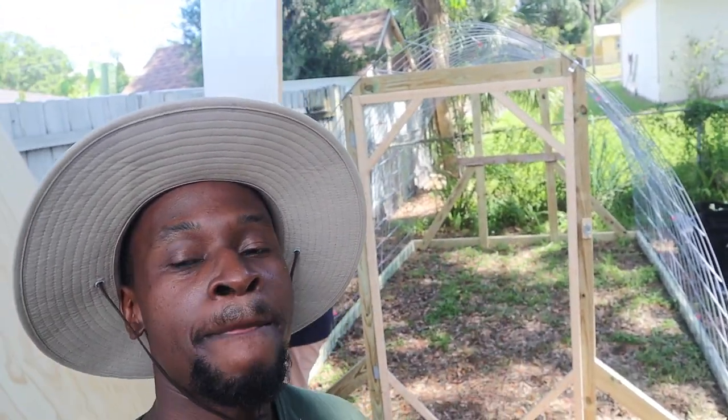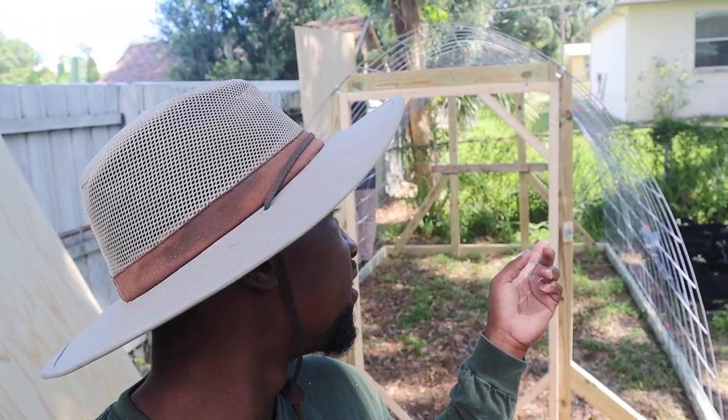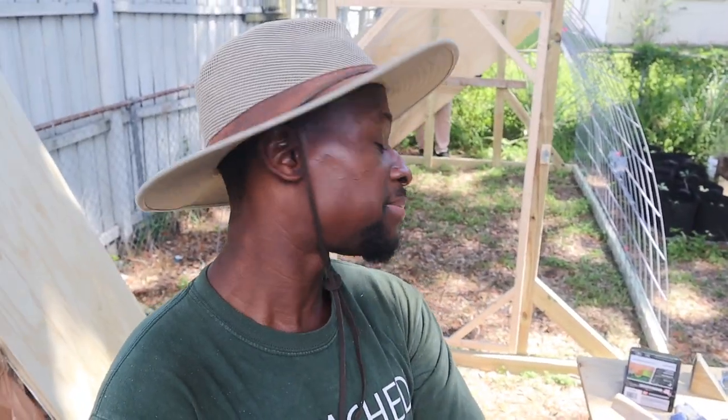First time doing doors, I will recommend you to use 1 inch by 4 inches, right, Frankie? Yes, sir. 1x4 because he said what I bought was too small. I think it was 1¼x2 or something like that. But nonetheless, spend a little extra money and get bigger for the frame itself. And just make sure everything is leveled and screwed accordingly, okay?